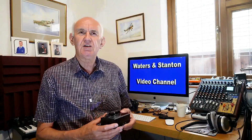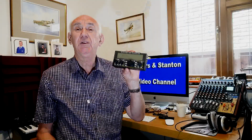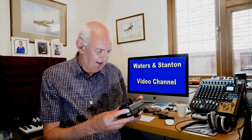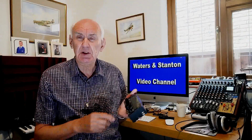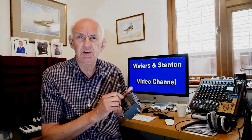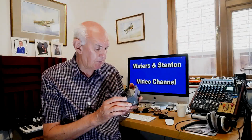So the features that I like on the KX2, quite a few actually. It's got a lot of features. The things that really stand out for me is the selectivity. You've got variable selectivity. You can go down to around 100 Hertz, I think, for CW, and open up to about 3.5 kilohertz for SSB. I normally set my SSB to around 2.4 kilohertz, but it's completely variable.